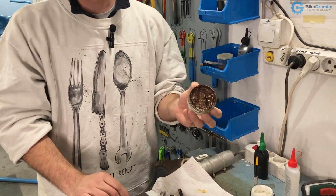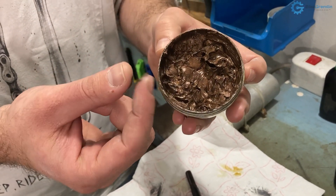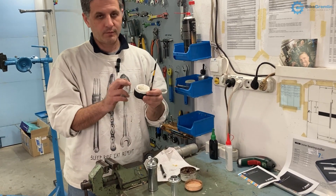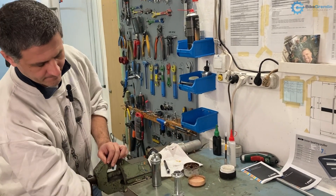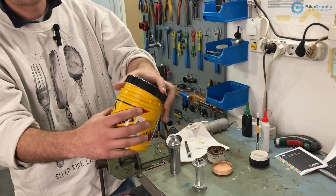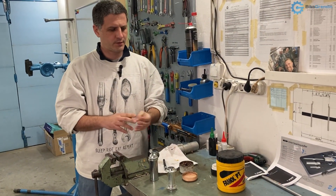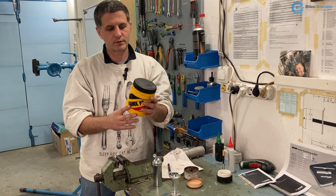This one is often called copper grease. It's also an anti-seize mounting paste and it's a lot more difficult to wipe off. It's a bit thicker and it looks like rust when you apply it, so it doesn't look very nice, but it's very efficient and very good quality. This one is made by a local Serbian company called FAMOL — F-A-M-O-L — model PT2. I'm not sure if it's available abroad or what the equivalent is, but it's worked very well for me. Mounting pastes are more expensive than greases — this bucket of almost one kilogram costs about 40 to 50 dollars, but it lasts a long time, and you can also get a smaller package.